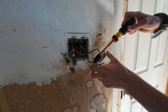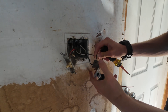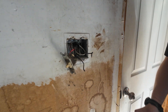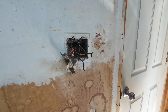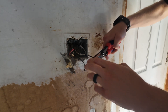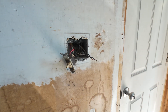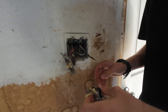I'm going to start with the right switch going to the outside light. I'll unscrew it, cut the wires, and redo them. I'm just going to cut them. You can see the old switch there — I'm going to take my strippers and expose some fresh, non-oxidized copper. That's just going to get shoved under our screws. I used a higher-end switch that has little plates so I don't have to do the hooks like the old one had.